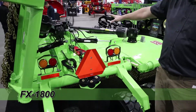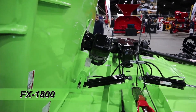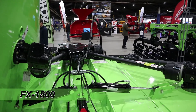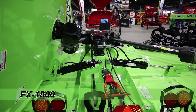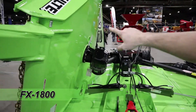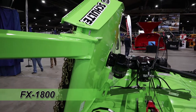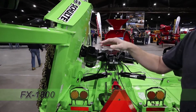The top of the deck is powered by a 225 horsepower gearbox down shaft, and the splitter box is 260 horsepower. This particular unit comes stock with one leveling rod, and you also have the wing over-center, which gives you a narrow transport and you never have to worry about your wings bleeding down hydraulics and the wings falling.